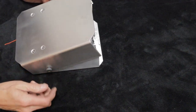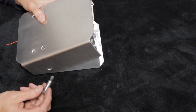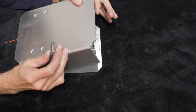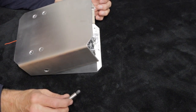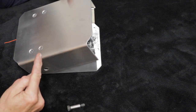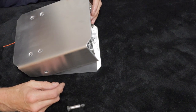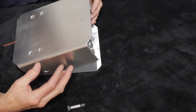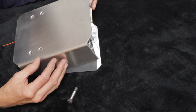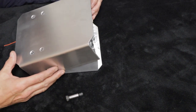I've got the pivots all done, bearing housings made for the inside, all the brackets for the pivot arm and potentiometer bracket finished. I still have to weld on the front and rear covers — I have them all cut out with a brush finish. I've got 3/8 shoulder bolts for the pivots. To make this a super smooth pedal, I wanted the whole top cover to be riding on bearings. The commercial aftermarket pedals just use a plunger that sticks out and is spring-loaded — it works fine — but if I'm going to build my own pedal I'm going to build one that's more precise and smoother, riding on ball bearings.